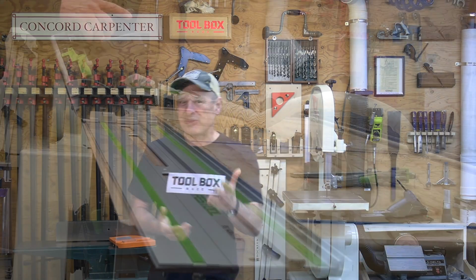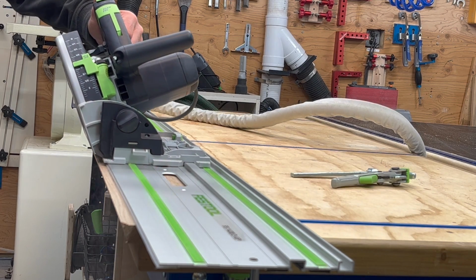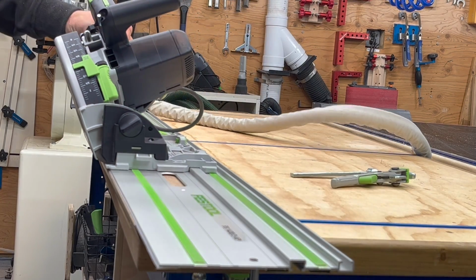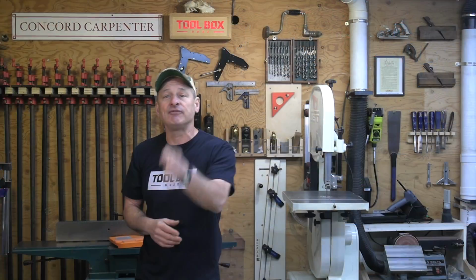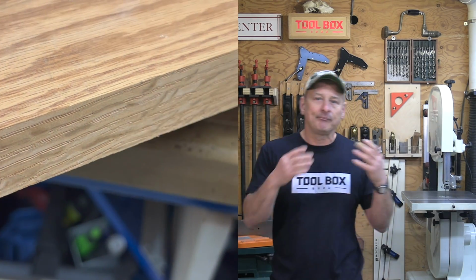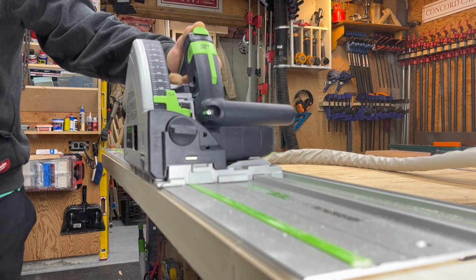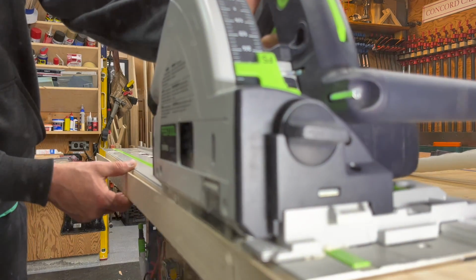So that's pretty good. We performed a bunch of testing here in the shop and a little bit on the job site on the saw, and we used it on a recent remodel. And a couple of things we noticed. So beveling at 22.5 degrees and 45 degrees, we did not see any deflection. I thought I might with a thin kerf blade. The alternating top teeth bevel, nice smooth cuts. Our analysis was that the saw feels and cuts faster and smoother. The cuts are accurate and smooth, like Festool is known for.